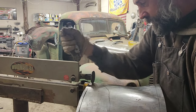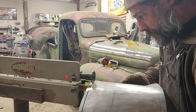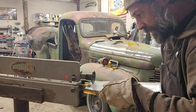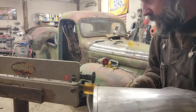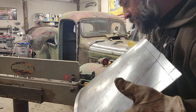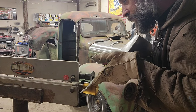All I'm doing right now is tightening it down. I like to get the piece of metal in there first before I tighten it, just to make it a little easier — we're just going to follow that black line. You see when I'm doing this, it's going to flatten out what we just did right where we're working. But after, we'll stretch it back out. After one pass, that's tipped up. Now this next pass I'll tighten down just a little more and put a little bit of upward pressure. I don't know exactly how much I need, but we can always bang it back down if we need to. So we're just going to put this bend in and see where we end up.